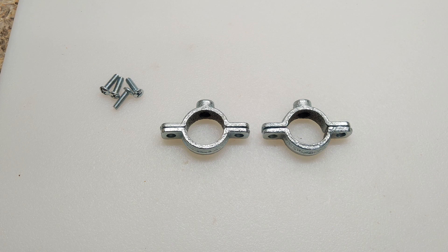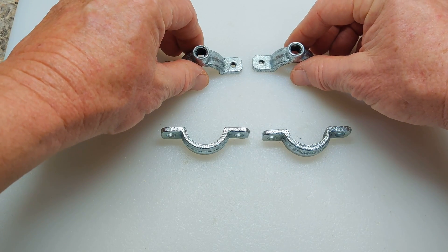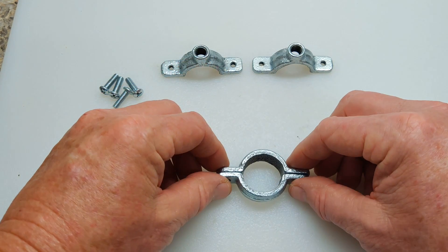You're going to need two sets of these three-quarter inch galvanized split ring tubing hangers, because those are going to function as your collar and gear splines on the shaft for the trolling motor. Those are the ones that engage the gear teeth on the gearbox motor. You're going to take these two top pieces away, which have been used before for foot pedal steering on a trolling motor shaft, and just use these two ends, putting them back to back.